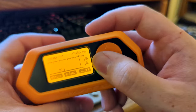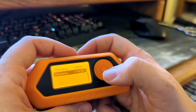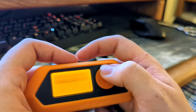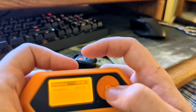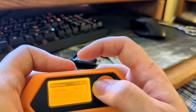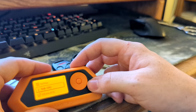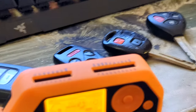What you want to do in this case is narrow in on which band you're searching on. Go to configure and drop it down — there are only four options. As long as you switch through all of them and find out which one you're operating on, then set the modulation correctly, you should be able to find whatever you're looking for. I hope you enjoyed this video — make sure you leave a like if you did.